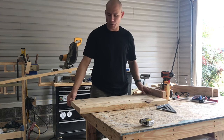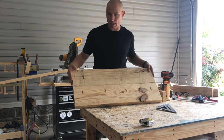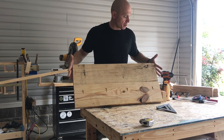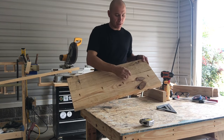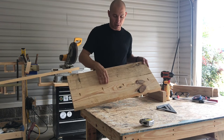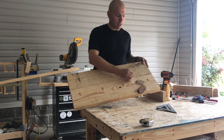It's pretty simple if you have some pocket holes and two-by-eight lumber. You can build it out of one eight-foot two-by-eight and have some extra leftover. What I like to do is rip the two edges that join together. In the previous video you saw where I used a straight edge to rip two clean edges, and I put those two clean edges together.